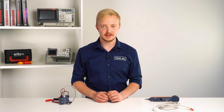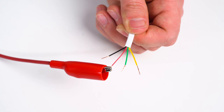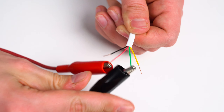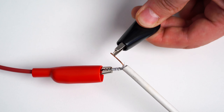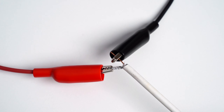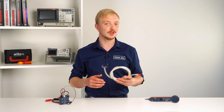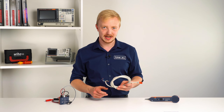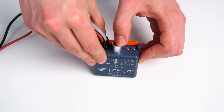If you want to send a tone across the wire, you either connect the alligator clips or the RJ plug. Here are various options depending on what you're dealing with. You can connect the two clips to the ring and the tip of the line, test a coaxial cable by connecting the red to the shielding and the black to the conductor in the center, or connect the two to the twisted pair. Make sure that the cable or wire you're testing is not live. You can also test for continuity or shorts by switching it to the short position.